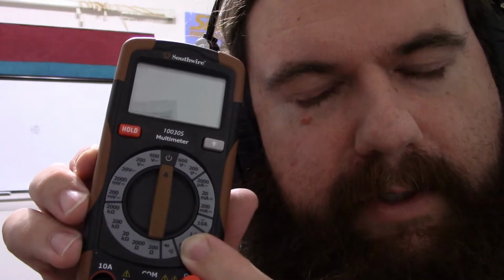So your multimeter might have a diode test mode, which is on the same mode switch as the continuity check, the thing that beeps to see if there's a very low resistance. You should use this mode if you can because it's going to give you a more precise result. But this mode only works for regular diodes, which includes the PN junctions in a BJT, something that has around a 0.6, 0.7 volt voltage drop. It's generally not going to work right on other things. But if you don't have that mode, let me quickly show you.